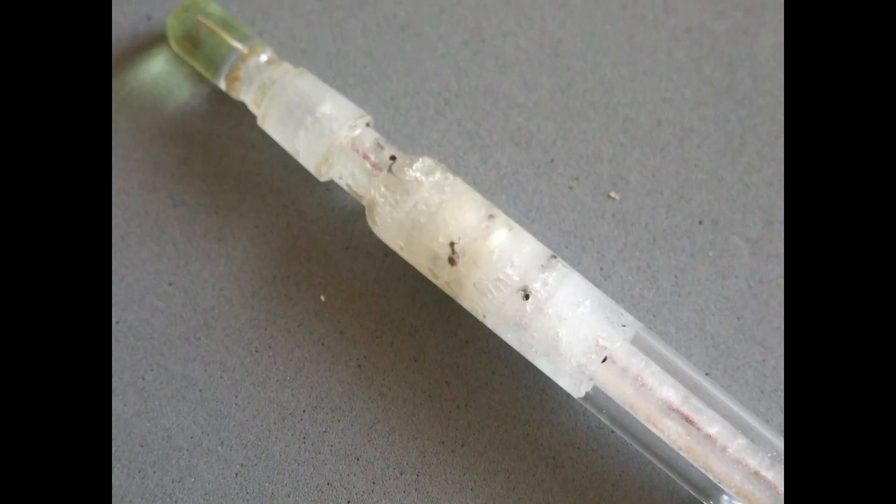In this case, the electrode refill opening was not closed properly and the electrolyte crystallized inside the electrode. And did this affect the result? Yes, these electrodes don't function correctly anymore and the result quality is very poor. You will see bad repeatability and slow response from the electrode.